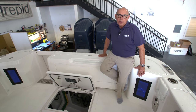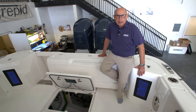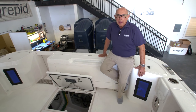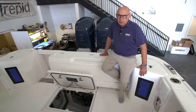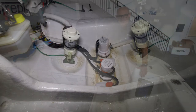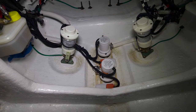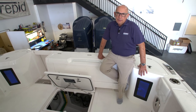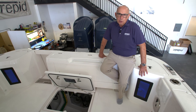Something to note is that if you're ever changing the gas filters and get any fuel in the bilge, you'll want to soak that fuel up with some kind of an absorbent mat. You don't want to discharge it over the side and you also don't want to have any fumes in the bilge. If there's raw gas in the bilge that would signal fumes. Gasoline is a very volatile substance and if any of it gets in the bilge you must soak it up right away. Safety first please.